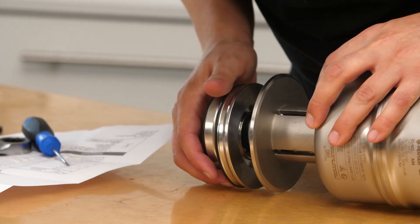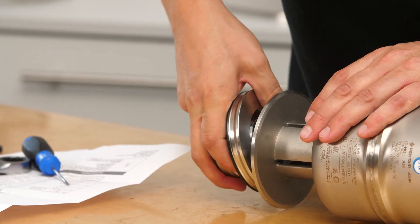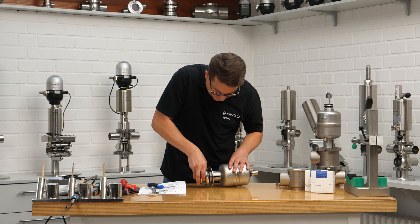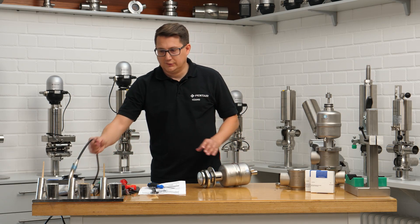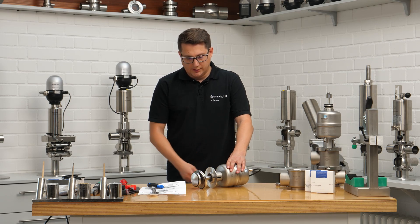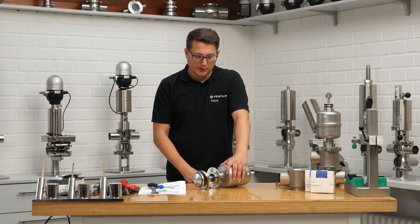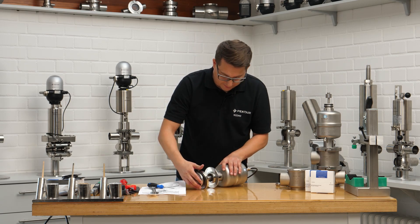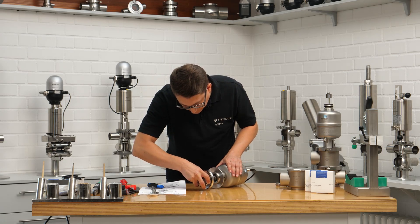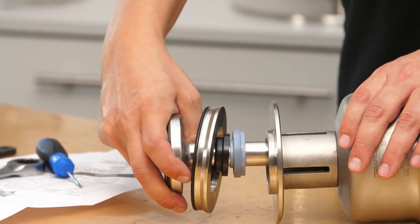Through the lantern, you see the orientation of the fast coupling, so you can push that up. If that's too difficult, there's a second way to do it — in this case, you can use air, so the coupling part comes further out. But then make sure you're not touching inside here, because when you accidentally lose the air, your hands are clamped — that's something you definitely do not want. So pull it out. Pull it back in — that's as easy as it can be.